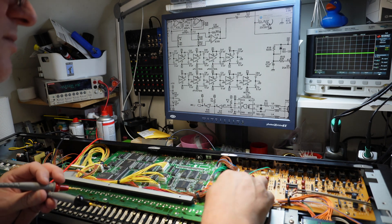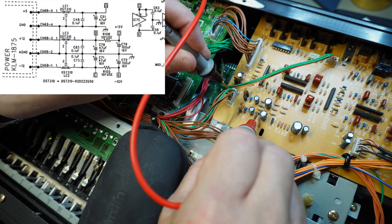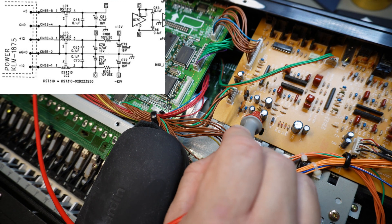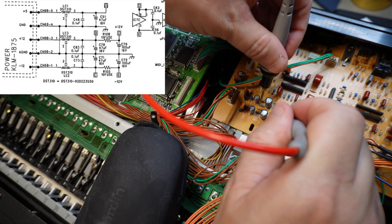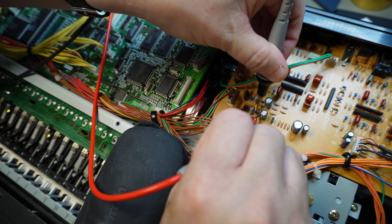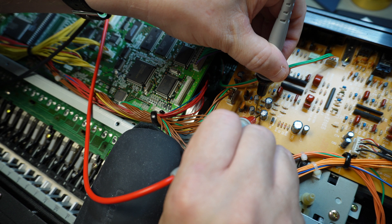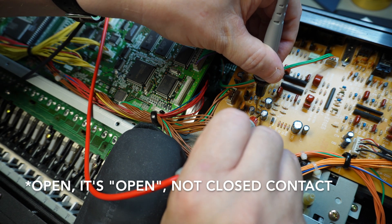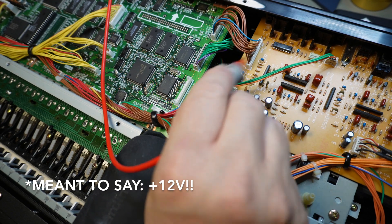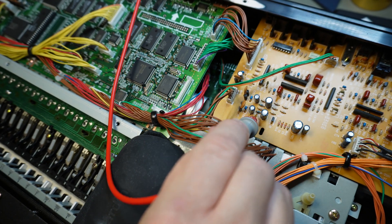Let's have a closer look at the power section — so where does the power stop? Powering it off. These are fusible resistors. Bang — nothing, it is blown. Now the question is, why did it go? If there is no minus 12 volts, there is no power to open the circuit. So the signal coming in here, which we saw, can never pass on to the outputs. So why did this blow?